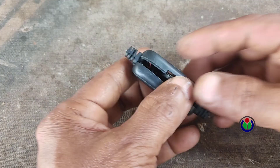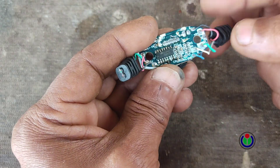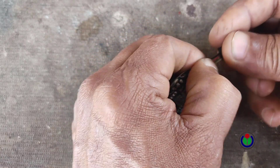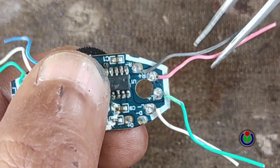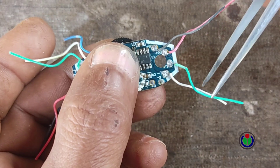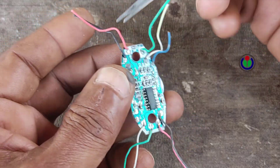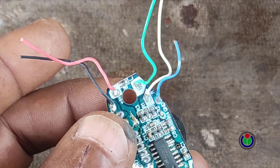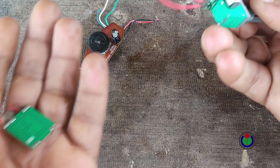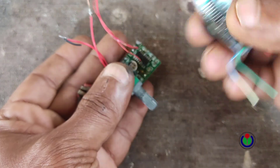Now I am opening the mini power amplifier box. There is a 10 plus 10 watt mini stereo amplifier in it. The red and black wires on the top are connected to the right speaker and the white and green wires on the bottom are connected to the left speaker. The red and black DC 5 volts on the left are used, which is usually powered by USB, and the other 3 wires are used as audio inputs.